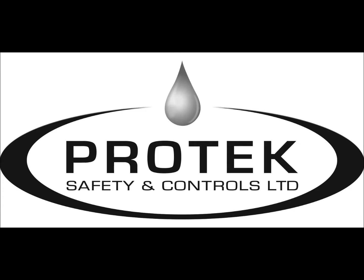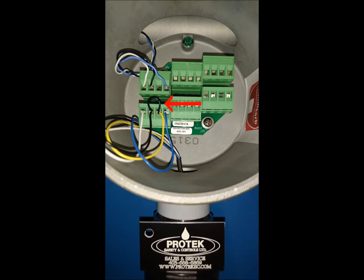As with all calibrations, be sure that the operator knows you are going to be doing a calibration and confirm that the unit is in bypass mode. When in calibration mode, the milliamp signal will go from a normal operating signal to a 2 milliamp signal. Please note that on the FP524D you will need to ensure that there is a jumper between the yellow and black wires at the sensor housing. Do not jumper these terminals if the unit is a DM500IS toxic gas sensor unit.